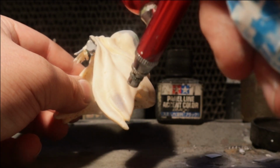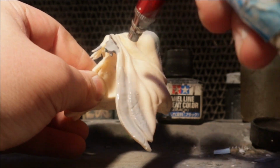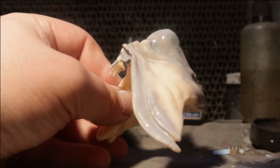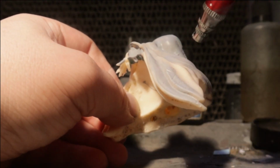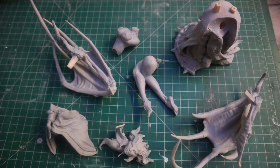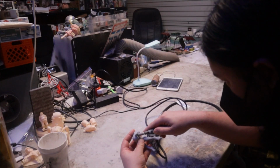Once cured and all excess material sanded flat again, each part was airbrushed with lacquer urethane automotive filler primer. Grey is selected as I can see if there's any major visual faults or any of the seams are problematic. Support nub marks, pock marks, visual and other issues.